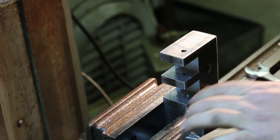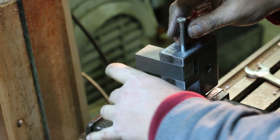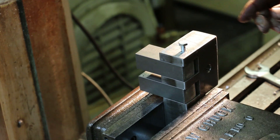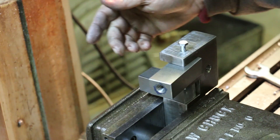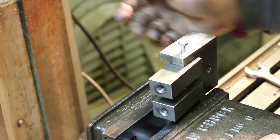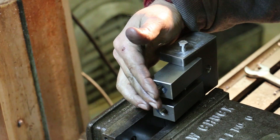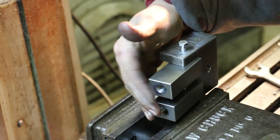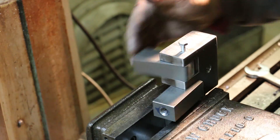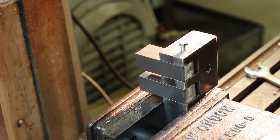After a little more grinding off camera, I've got these fitting together real good. The pins go in — I haven't got the bottom drilled and tapped yet, but these arms will just swing up and go back. I've got them going back just a little bit past center so that the weight will hopefully hold back and they won't fall over on their own. Both stops are pivoting real good, just like we want. Now I just need to drill and tap the hole in the bottom and we'll be very close to being done.